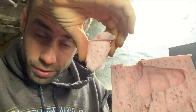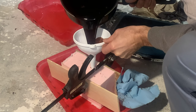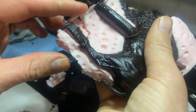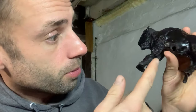We're finally to the point where we can test it. It ended up being six pieces: the two halves, a plug for the horns, a plug for inside the legs, and two plugs for the outside of the legs. In theory, everything should fit back together and lock in place, and I cleared vents for the feet and the tail. It's kind of satisfying when all the plugs are removed and you're left with an exact copy of the original — no damage, no broken legs. All the important detail around the face is captured, the tail is captured. There is a parting line along the back we'll have to deal with, but the parting lines along the plugs are pretty good — you won't have to detail those at all. There's a little issue around the plug for the horns and the hump; I'll need to do a little wax chasing for that. But overall I think that's going to work out pretty good.